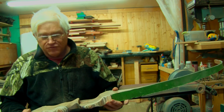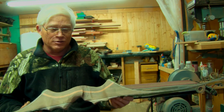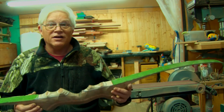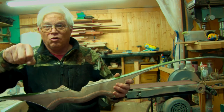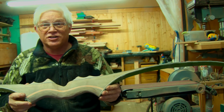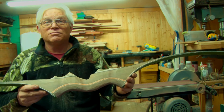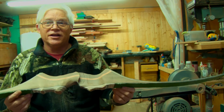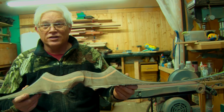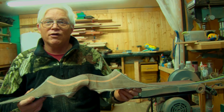And if you're going to use a carver, I would use a two-handed type carver. I've seen one. I've never looked to purchase one, and you hold it in two hands. It had a carbide cutter in the middle, so you just go and peel off like this. You could use a spoke shave and do much of that too, except where the glass is. I'm just not fond of using power carvers. I tried using them in the beginning to expedite things, and it really just slowed things up, and I wrecked some handles and had to jerry-rig how I formed them.